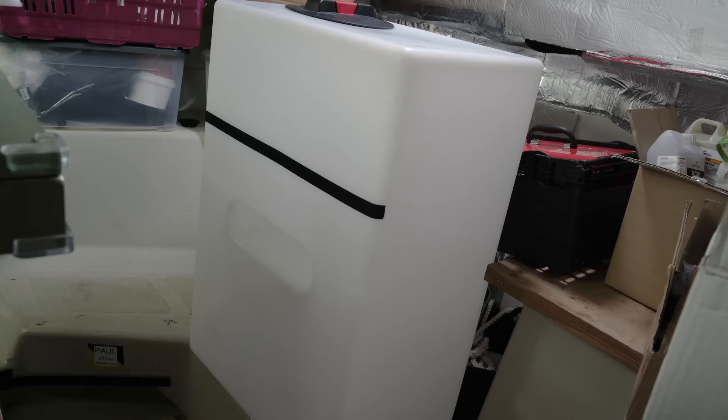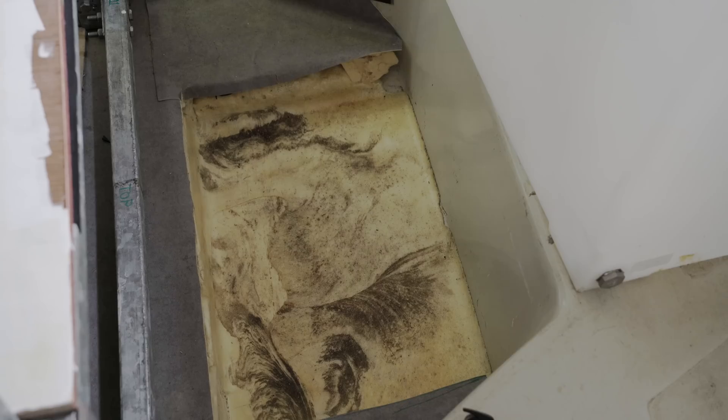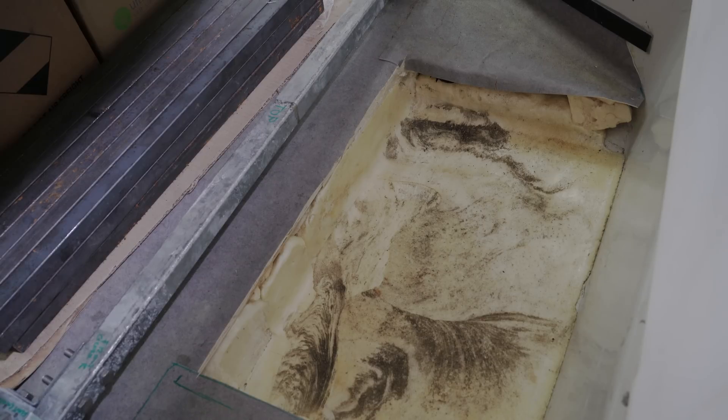For those interested, it's a standard 210 litre food-grade water tank, translucent for easy inspection, with a large access hatch at the top and a small drain at the bottom that I've sealed and plugged for now. There's also a baffle which limits sloshing around but helps lifting. It'll contain pumped drinking water and melted snow. Many moons ago I bedded it onto a thin layer of marine-grade two-part polyurethane foam, tilted aft slightly to allow for the curves of the bilge and to stop it protruding into Alan's precious internal space. The foam doesn't stick to the medium-density polyethylene, which is helpful.